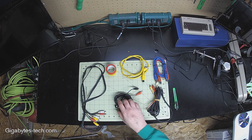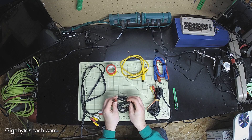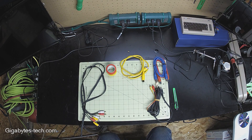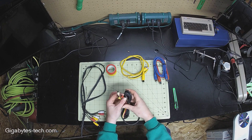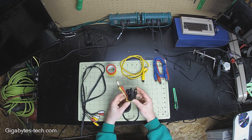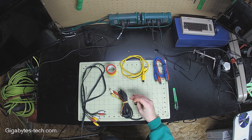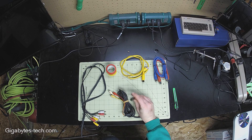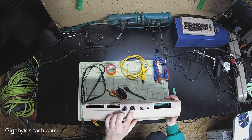Today, we're going to build one of these. This is a 5-pin to RCA connector for the audio/video on a Commodore, and I did get this with my VIC-20. I did find another cable — an audio-video cable for a Commodore — and this has an 8-pin connector. This is nice and all and is what most Commodores have. My original Commodore had an 8-pin connector. The problem is my Commodore does not have an 8-pin connector — it has a 5-pin connector.